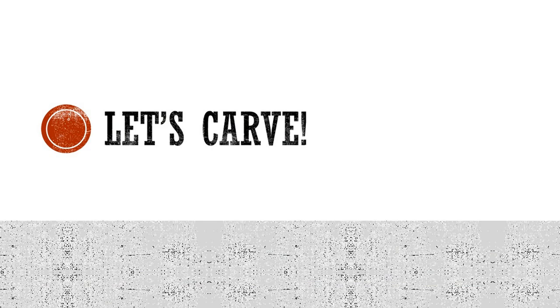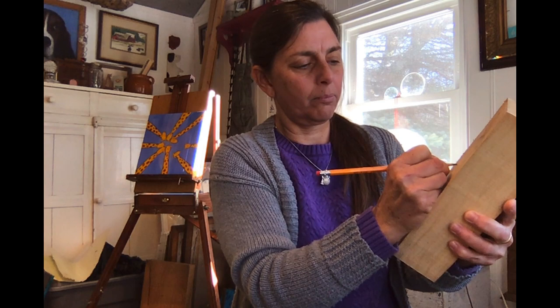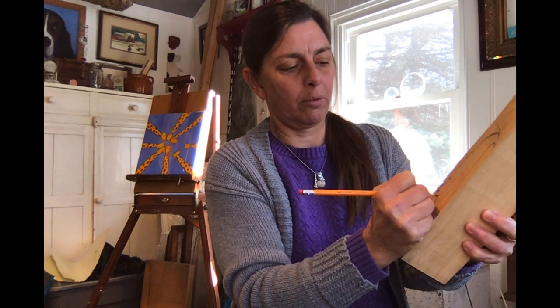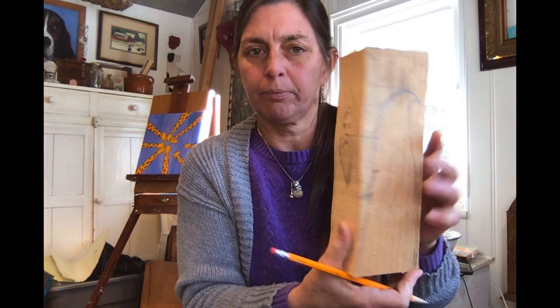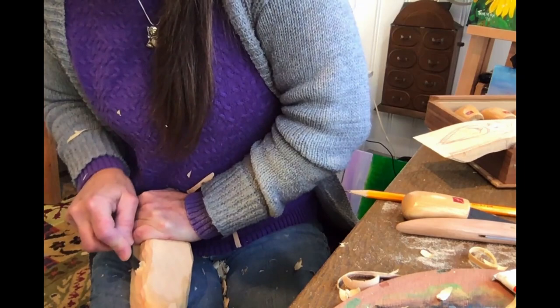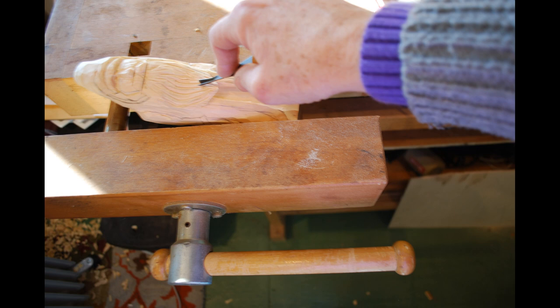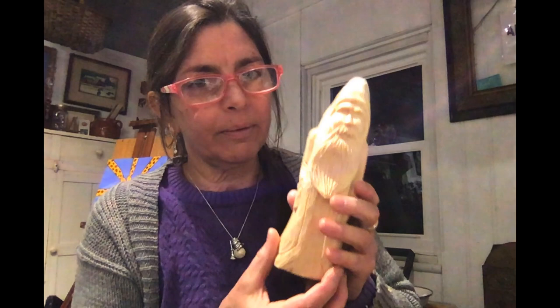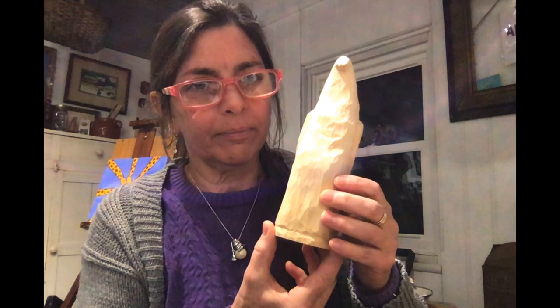Now it is time to sketch the basic shape onto the wood. Because we are working on a three-dimensional piece, it is important to consider all sides when drawing the form on the wood. Use a smooth cut side at the bottom edge, which will allow the piece to stand on its own, and keep the bottom the widest when sketching, forming a triangular shape when looking at the front of the block. From the sides, the top should curve back and the nose should protrude. If you have access to a bandsaw, you can rough cut the shape; otherwise, start removing wood up to the sketched lines with a knife. Cut into the wood and slice away from your hand and body. I continuously turn the piece, working not in one spot for too long to be sure not to take away too much wood in any one area.